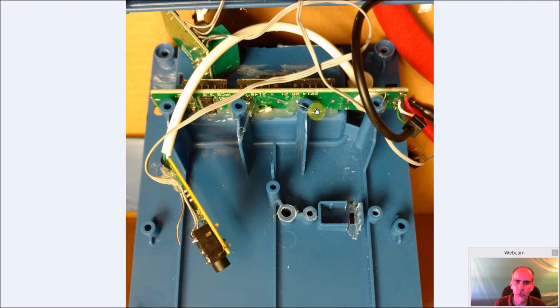So I got the 3 ports in here, and then this is a USB sound card, which comes around to where it is inside here. And this will be hot glued in place. You can see all the hot glue. This is not going anywhere. Here are the ports. I drilled a hole here for the PAM volume control, which is in the battery compartment. So set the volume, close the battery door, can't even see it.